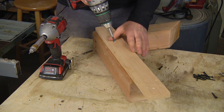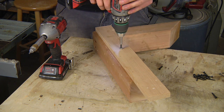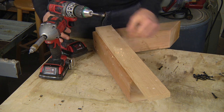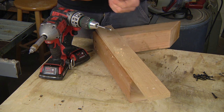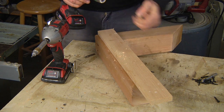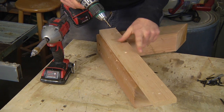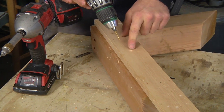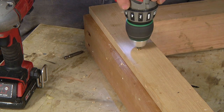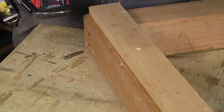You can do it in any material. Here we're going to drill some nice, clear hemlock. So you do the big hole first. You don't need to go very deep, just the thickness of the head of your screw. After you have the countersink drilled in the surface, you go ahead and drill the pilot hole for the screw, and the center is marked for you already. Now all you have to do is drive the screw home and it should look really good.